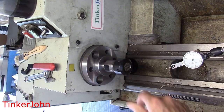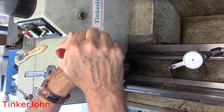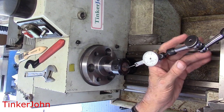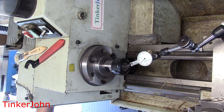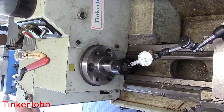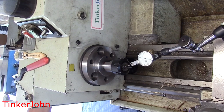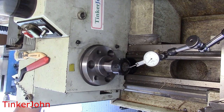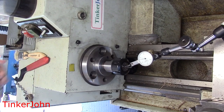Let's try another one — a 1/8 inch drill bit. This is a brand new drill bit I just pulled out of storage, never been in a chuck. I sure wish I had one of those fine-tuned indicator holders, but I don't. That's with an eighth of an inch and that's just unacceptable. Let me bring it out a little bit — I may be on some writing where that thing is held. Now that I'm up and got some good meat on that drill, I'm at about a thousandth. As you bring it out, that's quite a bit. But if it's up there close, at least you can say where it's sticking out of a collet it's within a thousandth of an inch. On a quarter inch, I'm rocking about a thousandth of an inch near the collet, but it's coming up quite a bit off when you get out to the end. I don't like that.